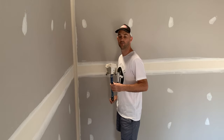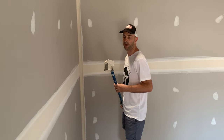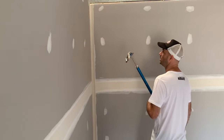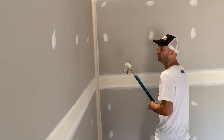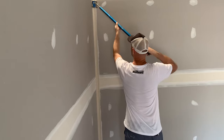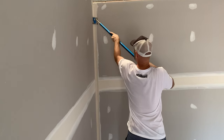What we're going to do now is just show you with our corner finishing handle on our new glider glazers, just how to finish off the internal corner. We start from the top again — we've got a bit of mud on the glazing head. The glazing head on these is 60mm as opposed to the other ones at 55mm. We just start at the top. Again, it's important just to apply enough pressure to hit the apex of the corner, making sure you're at 45 degrees, and then down we come.